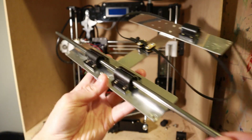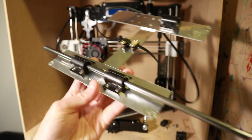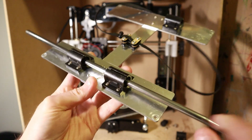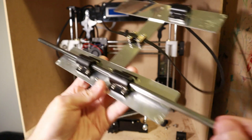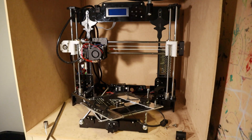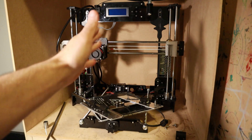On these linear rails, there are some really bad bearings going on in there, and there's some bad scoring on these linear rails as well. So these bearings have failed — these linear bearings — and that's pretty consistent for pretty much all of them.